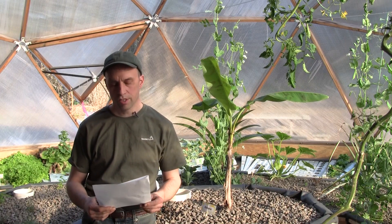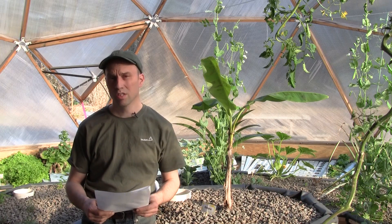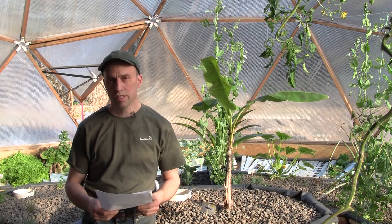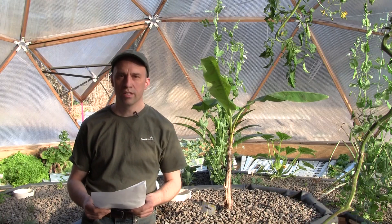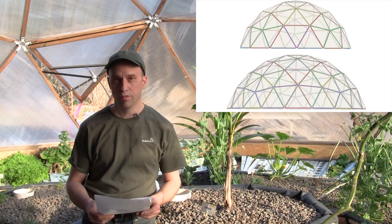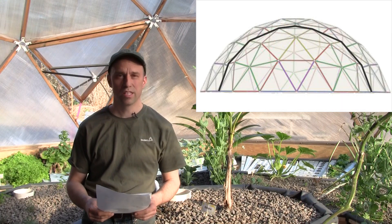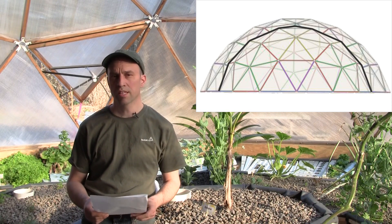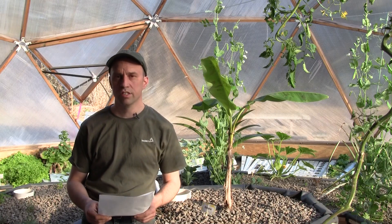Question number five: would you build a larger dome someday? This is a 32.5-foot dome — a frequency 3, three-eighths dome. The next stage would be a 40-foot dome, which is a frequency 4, three-eighths dome, increasing floor space from 820 to 1,151 square feet — about a 40% increase. It gets a lot more complicated going from a 3V to a 4V dome: I have 5 different strut lengths and 45 hubs in this building, while the 4V goes to 10 strut lengths and 71 hubs, with triangle shapes jumping from 5 to 11. Most likely if I went bigger I'd use a standard traditional commercial greenhouse.